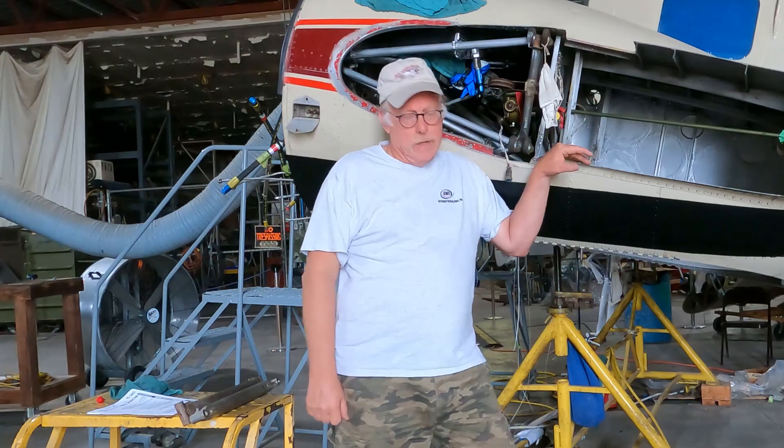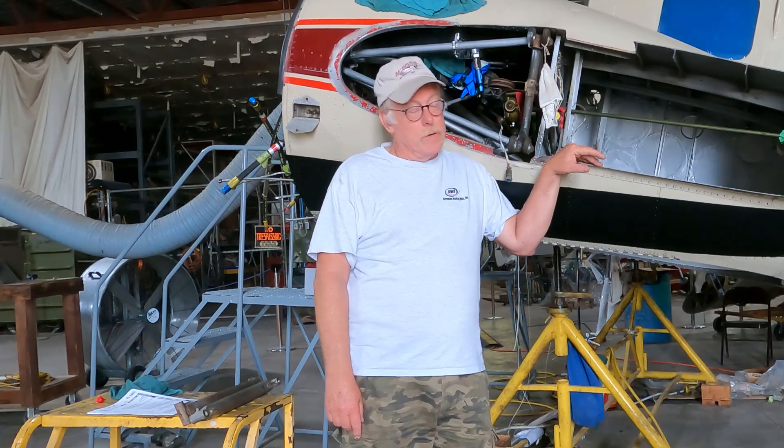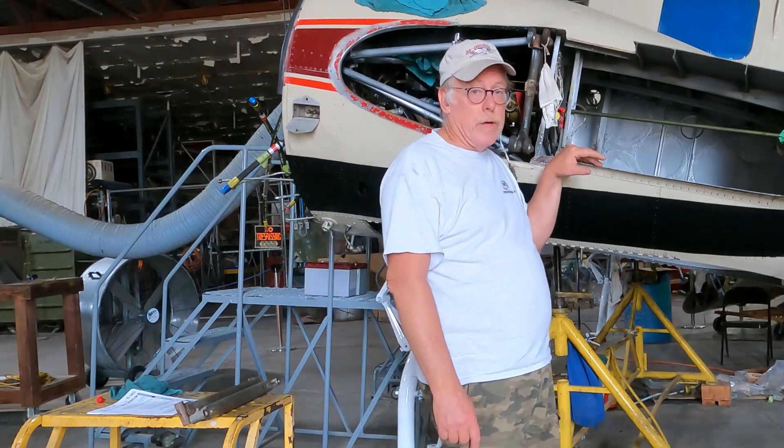You should be good for 1,500 hours after that. Again, since we've got a crack on one of ours, that means something got racked, so we're going to put the stink eye on the trolley too — make sure it's good — and double check our gear legs. Biggest thing: this isn't something you do all the time, but SI 1183 is a good one. I'll try to put the PDF in the Beech 18 Facebook group if it isn't already there. 1183 — it's a good thing. If it hasn't been done, do it. Go fly, keep those birds flying.